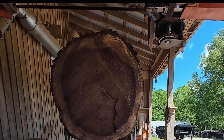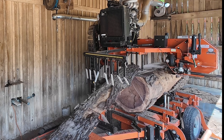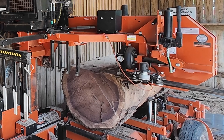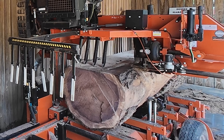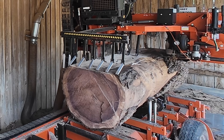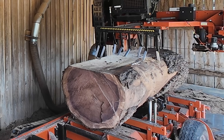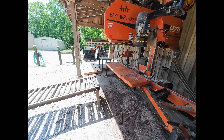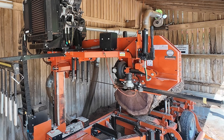This is a big one. I'm starting where the stress is going along a vertical line. I didn't go deep enough on this one, so I'm going to raise my offside toe board and take a skim cut — see if I can get a flat surface through it. I want an even run all the way down the face of this log. That looks a lot better. Sometimes you have to take a second cut, but this is about what I want. Drop the toe board.